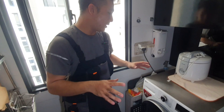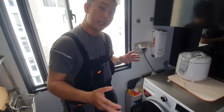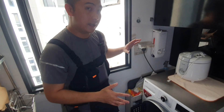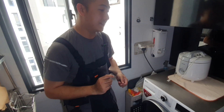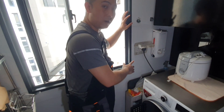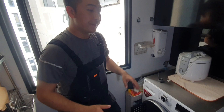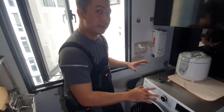Sometimes as you're going through the house checking what works and what doesn't, you come across some sockets. To test if the socket is working, you could plug in a phone charger or a fan to see if the socket is actually powered up. In some cases, the socket might not be powered up because it's connected to the inactive circuit breaker, which means your appliance may be faulty. If you come across that scenario, turn off all your appliances, remove them from the wall, and then reset your circuit breaker. If that works, it means one of the appliances is actually faulty and needs to be changed.